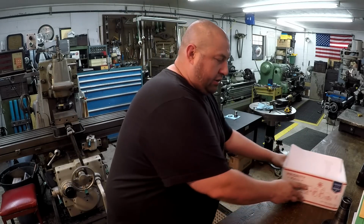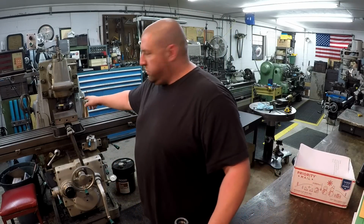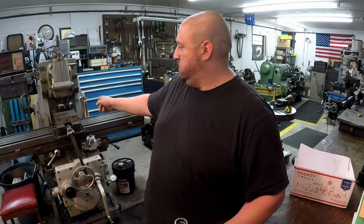So I was also going to mention that we've got that T-Max 45 face mill over there that was given to me by Kevin Alexander. I've got a video of that setting the inserts and then making the first test cuts over here. But Kevin actually sent me a couple of 50 taper holders. One is in the mill right now. That's the inch and a half pilot. That's what the face mill is mounted on.